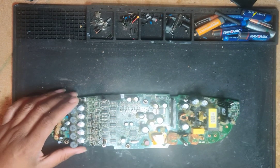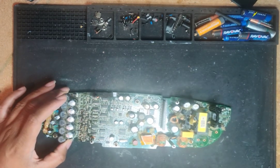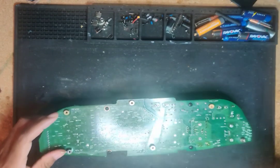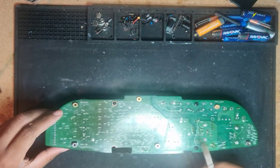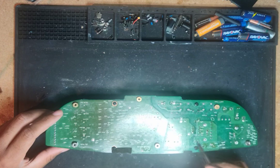That white one I showed at the beginning — that one didn't power up. It took me a long time to figure out what the problem was. What's happening is after the power supply, it hits a coil — it's basically a three-tap coil where the center is ground, and you have a 12-volt and a 24-volt output. My 12-volt was never going to 12.